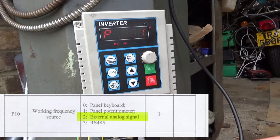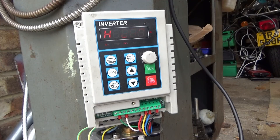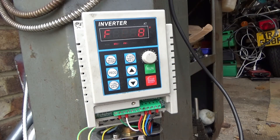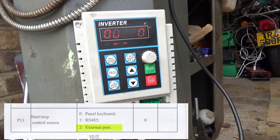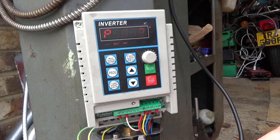That should work now. Let's press program it. Run now. That's worked. Next one is to set the start/stop control source and go to Program 11. That is currently set to zero and we need to set it to two. That's working.